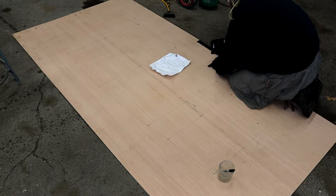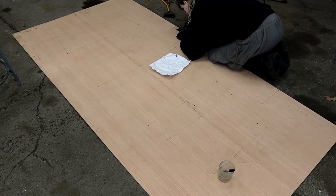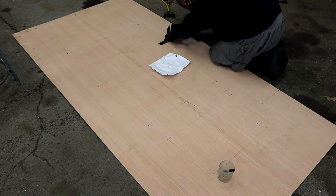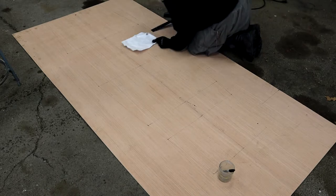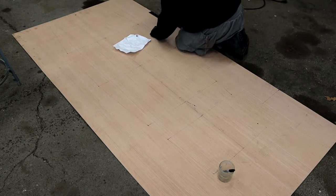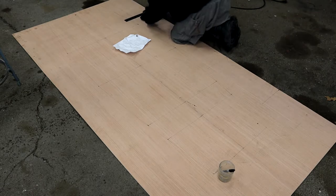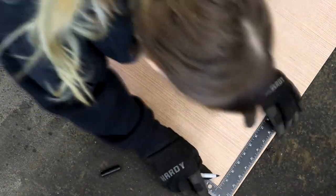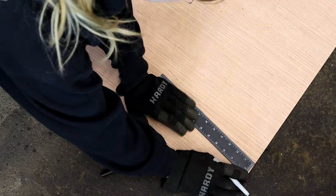I make a line for each section of the chine, which is shown on the plans. These lines don't actually connect yet, but once I finish the entire chine, I will go through and make a line that connects each point on these. I'll show you this in a second — I'm just trying to make sure that my dimensions are correct on each section, because that's the important part. And here you see me marking the chine out by connecting all of the little reference points that I made on those sections.